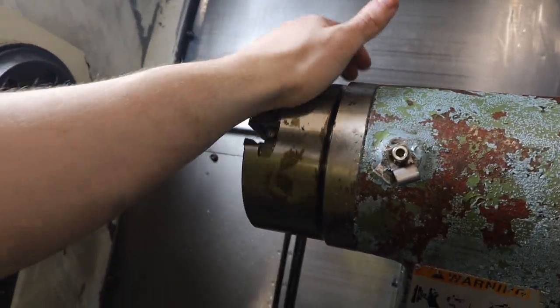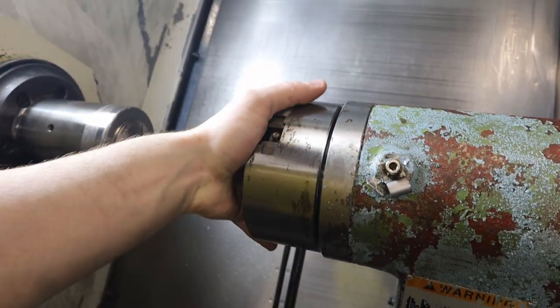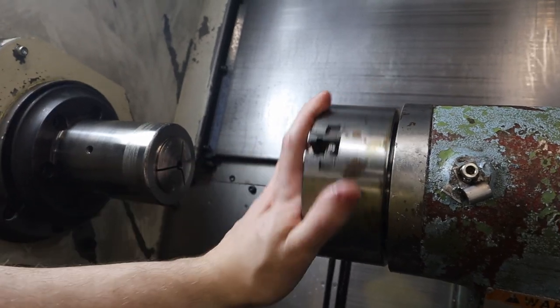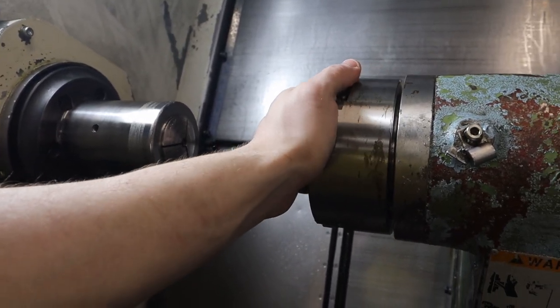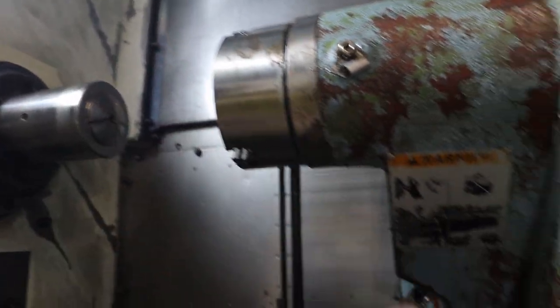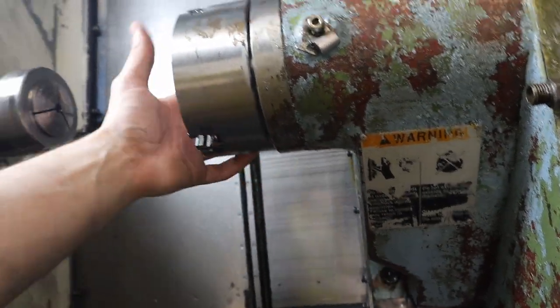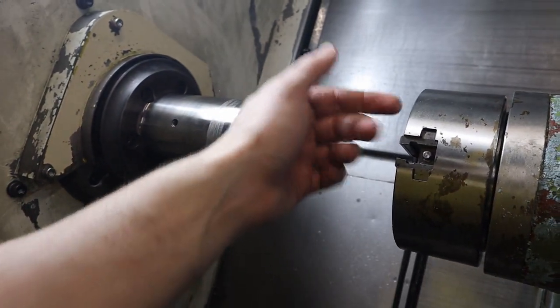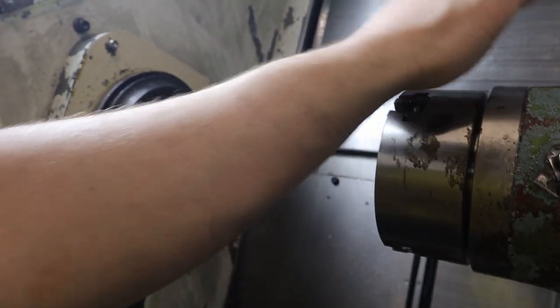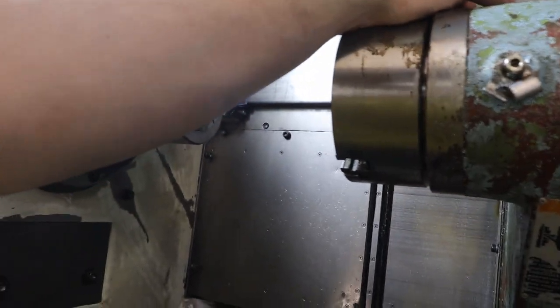So that took a really long time, and for a while I was like, I'm not really sure I'm doing the correct procedure, but it seems to have worked okay, so we're good now. One of the big pain points was I would tighten the bolts down that actually snug the thing, and then it would move our concentricity readout off, so that was a pain.